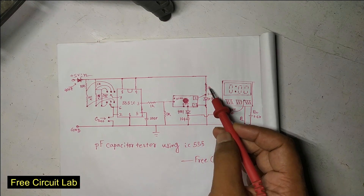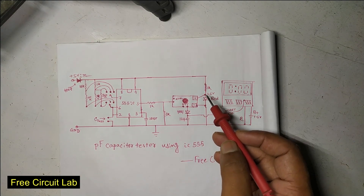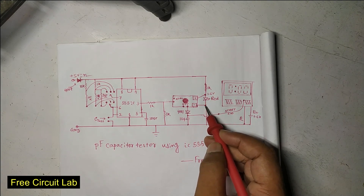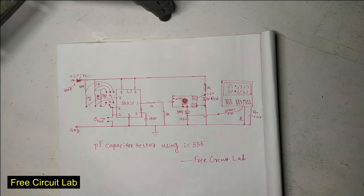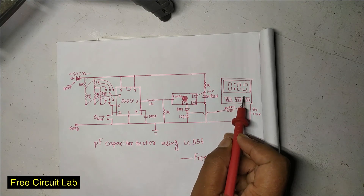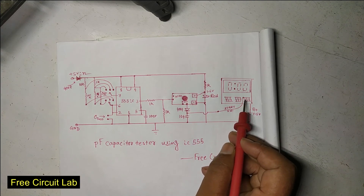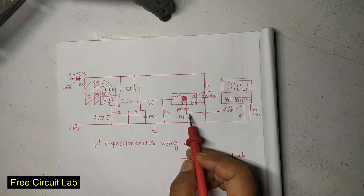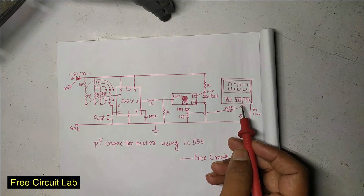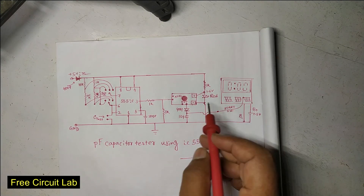To power this board I used a clever trick. There is an indicator LED — 1K resistor and a red LED. A red LED drops around 1.6 to 1.8 volts, so I connected the positive and negative of the LED directly to the power pins of the NRF clock board. There are two output pins on this board; I could connect either directly to the pad, but that would disable the manual button function. That is why I used a diode and a capacitor to keep it stable and prevent missing narrow pulses.